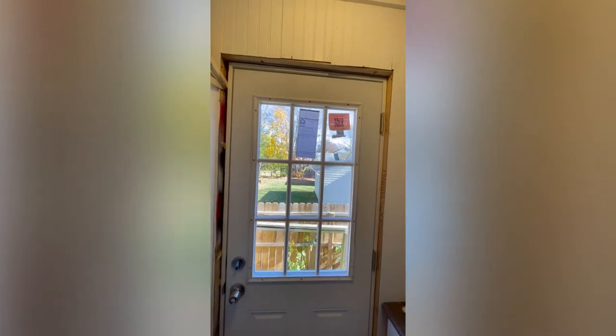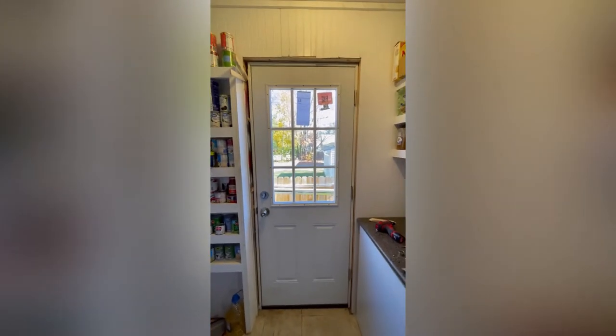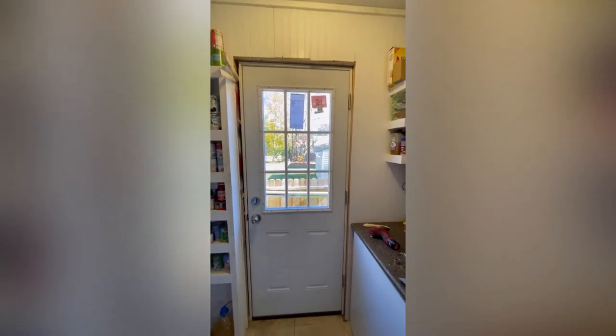The wall actually leans out about an eighth of an inch on the left side, and the right side leans out just a hair more. The hole wasn't perfectly square, so I had to put the door in by feel — I just put it in and open and close it until it feels good, then pin it. The top line is good, and the hinge line looks really good. That's basically changing a door on a mobile home. Actually changing a door in a normal house with a standard hole is even easier. The next video will be a sliding barn door going into this pantry.